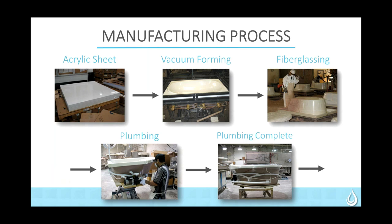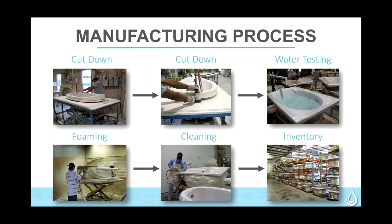This unit is half done in fiberglassing. The fiberglass is this pink resin applied onto the full back of the tub. We fiberglass the entire tub, then it goes through a curing process — through a heating oven — and we actually fiberglass the entire unit again. So you're getting two coats of fiberglass chop on the back of the tub, which gives added strength. You'll notice it's a much stronger, heavier weight unit because of the two coats.